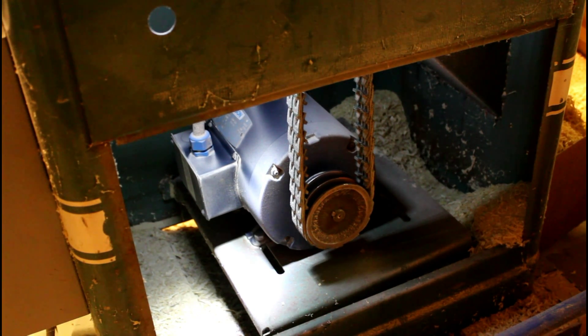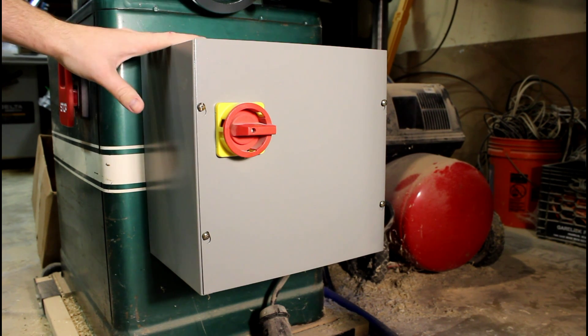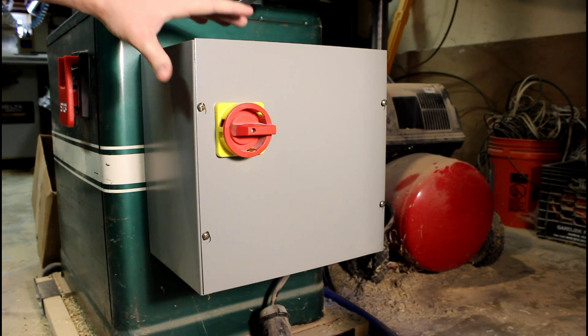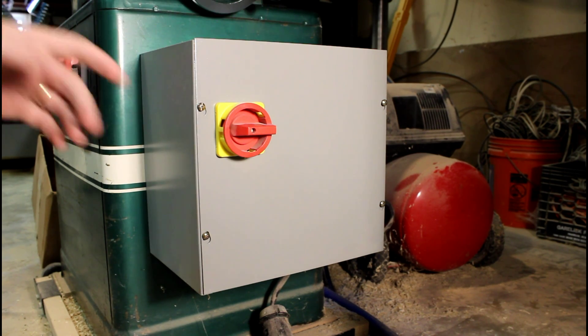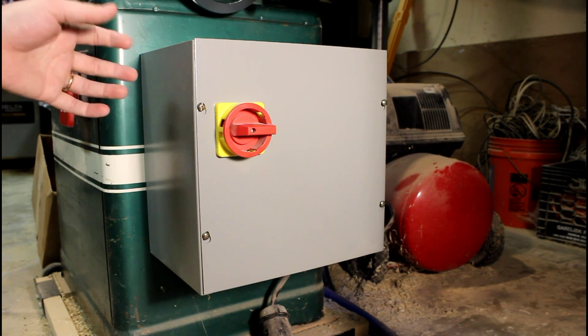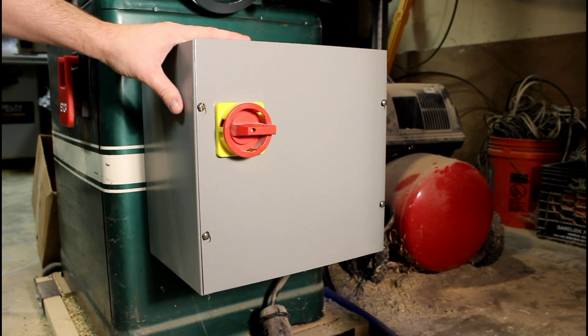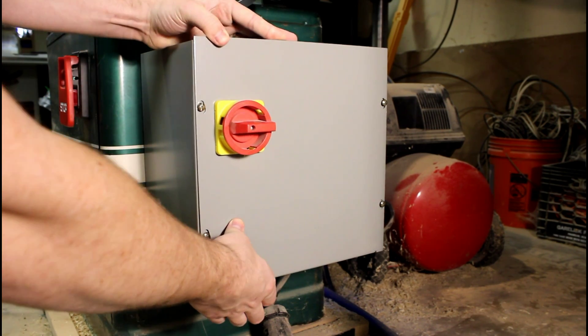Let's go through the basic connections and show you this enclosure where I've mounted the VFD, and how this thing is wired up. This is just a simple junction box enclosure — I'll put all the parts in the description for a nice neat build materials list for implementing this yourself. I wanted a way to protect the VFD and some of the components internally from dust as best I could. Mounting this on the wall would probably make for better use if you have multiple machines you want to hook up to three-phase power with one VFD.